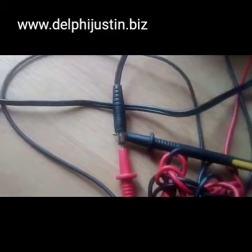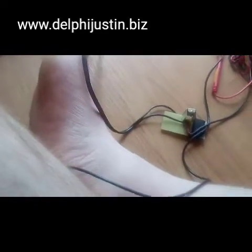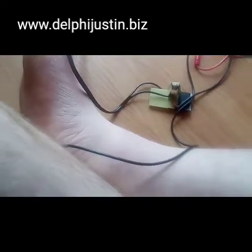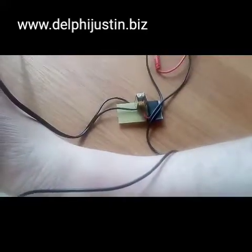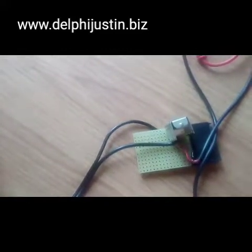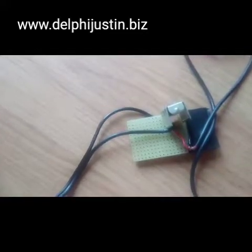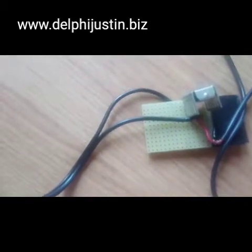This power supply is 12 volts at 2 amps on the one right there. And the DVD player is like 9 volts at 1.5 amps, so it's getting like a half amp more, which is even better. It doesn't need to be 2 amps. It needs to be at least probably 1.5. Maybe not even 1.5. Some of that stuff's just estimated and probably given as a rule with the one that comes with the DVD player.